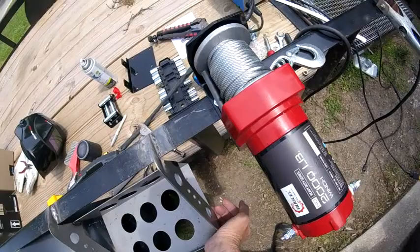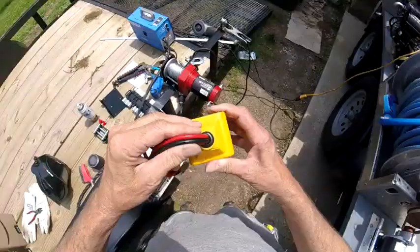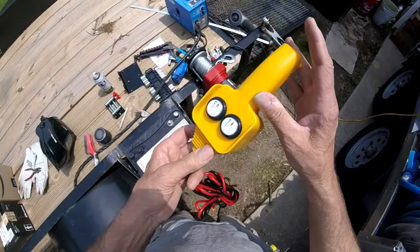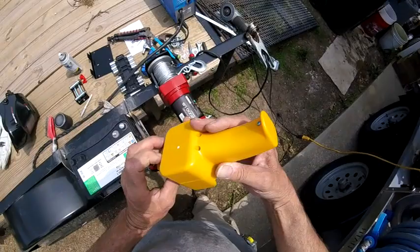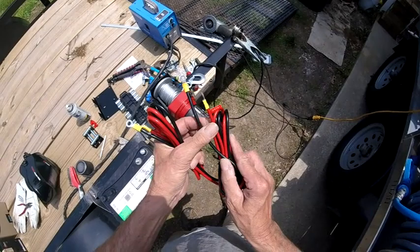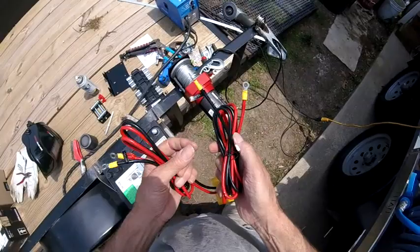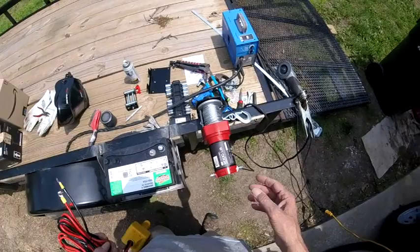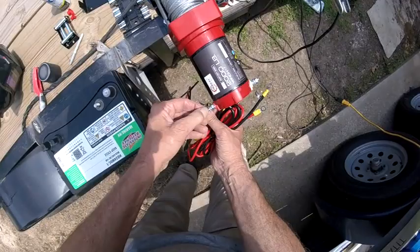Solid — I was afraid that part might be a little weak, but it's not. Nice and solid. It says this is waterproof — I think it's weatherproof, because I can see right into the switch. You could buy a truly waterproof switch pretty reasonably, or put it in a waterproof box underneath. Here's the power plus or minus, and here's the motor plus or minus — you can rearrange the polarity on either one. Changing polarity changes the direction of a DC motor.